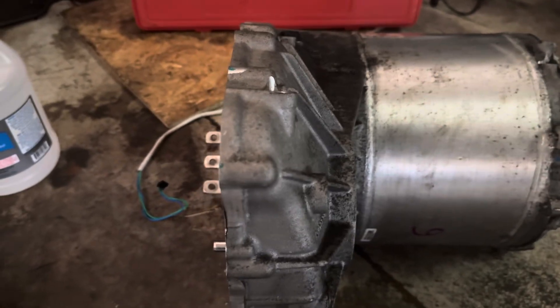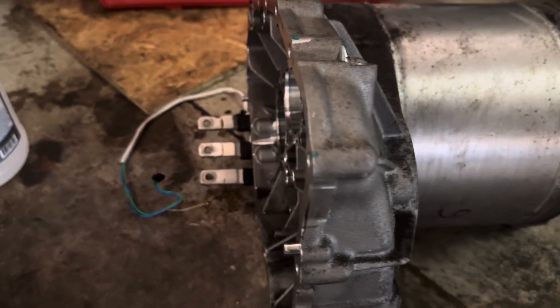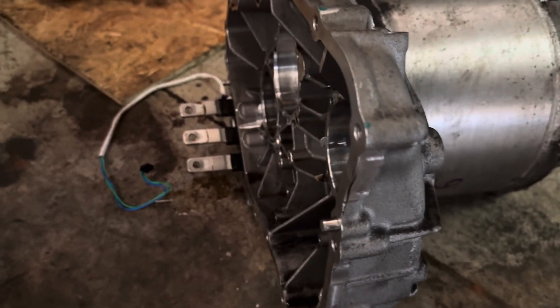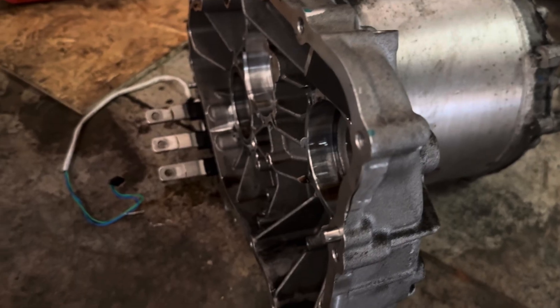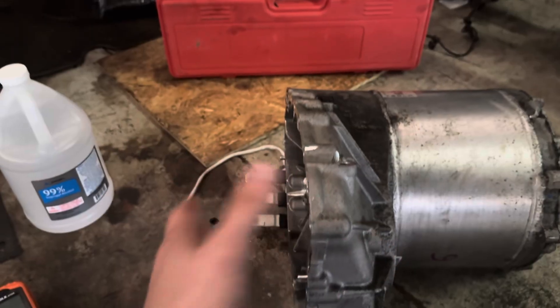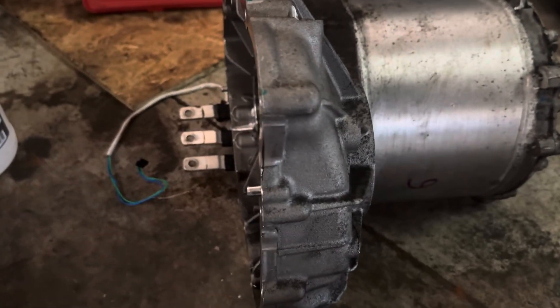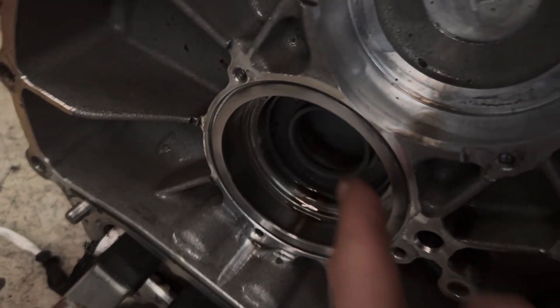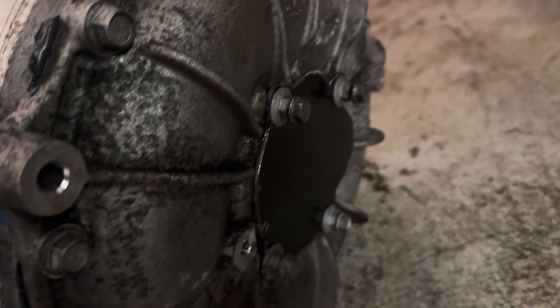What we're doing now is separating the components out. The inverter needs to be removed and the whole drivetrain needs to be removed. That's easiest to do when the motor is positioned upright with the inverter up. Once all of that is removed, we remove the rotor, including this bearing right here.